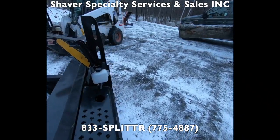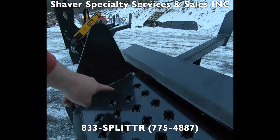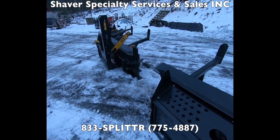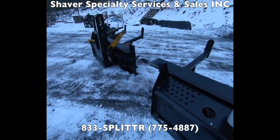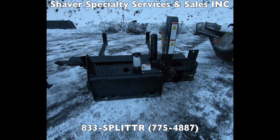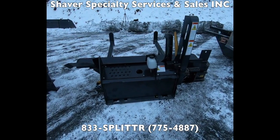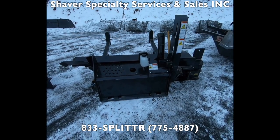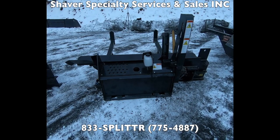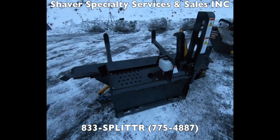And what I was mentioning before, the computer piece is actually down inside the unit here versus being inside the cab of the machine. So that gives you the plug and play option for the 14-pin adapter. So if you have at least 5 function buttons inside your cab, you can run this on the 14-pin electrical connection. And we just found a Skid Steer Genius connector that goes into the 7-pin Bobcat, so you can run that right off your factory Bobcat controls.